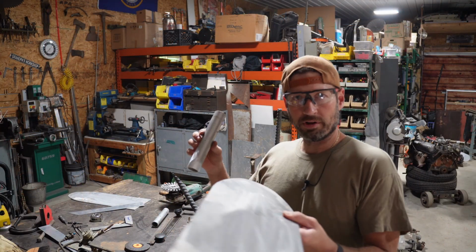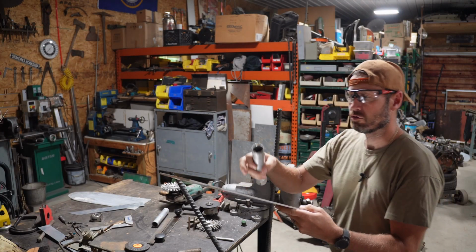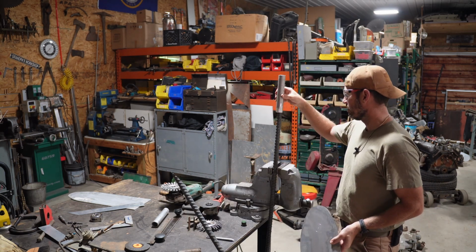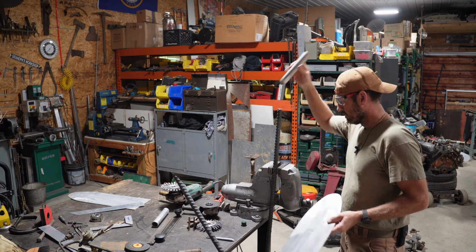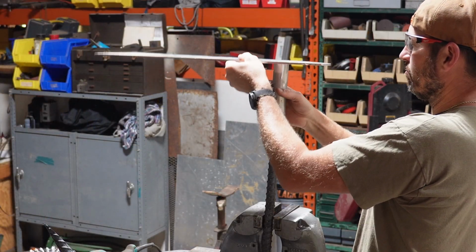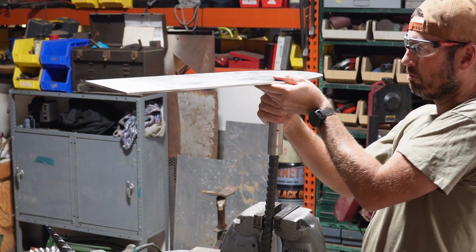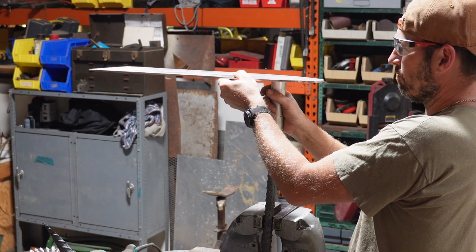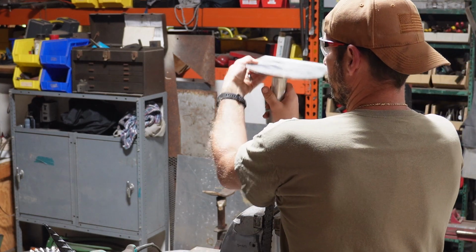All right, everybody, here's what I've come up with so far. It's a pretty heavy-duty aluminum plate with some aluminum pipe. This is 1.5 inches, and it fits over with a little bit of slop. This pipe will get mounted to this plate. So this will mount similar to that, so it can swivel back and forth. It'll be in the pathway for one use and can just swing out of the path.